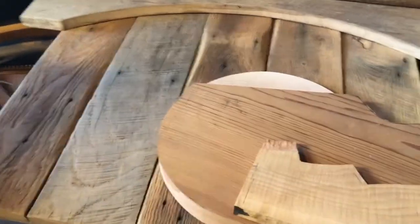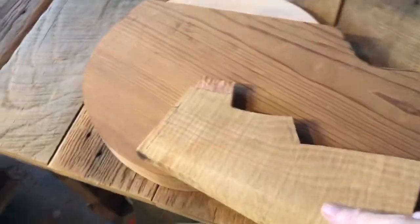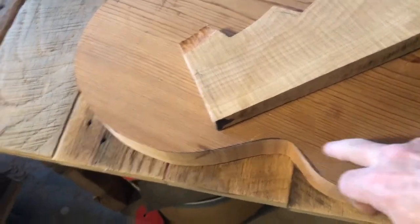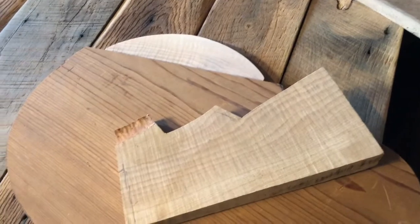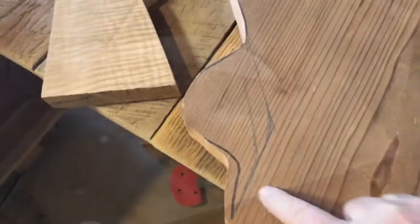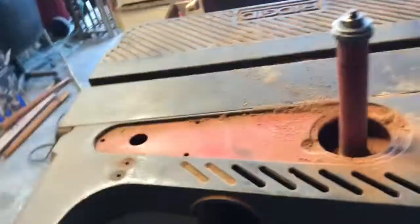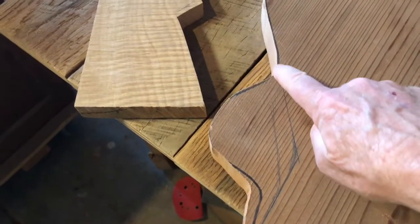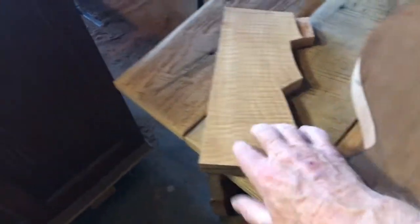This is a kind of work of art in progress. I think we're going to do this horn too — go straight across there and bring it out with some more flamed maple. Let's draw it out and see the line. I think that'll work wonderfully. We'll round that off with the spindle sander — whack this off on the band saw, get as straight a line as I can, round it off, and fill it in with the flame maple.